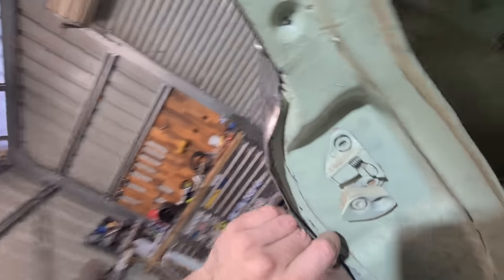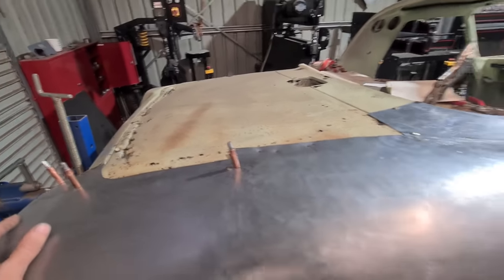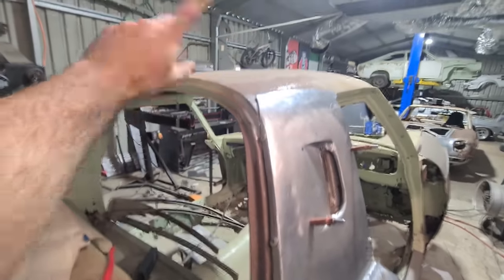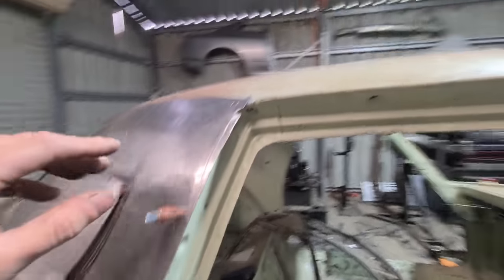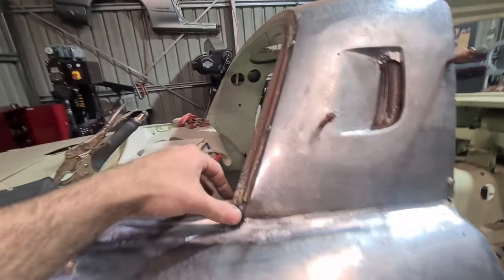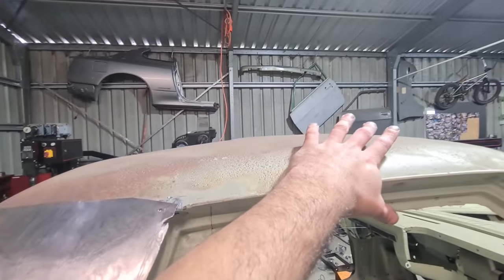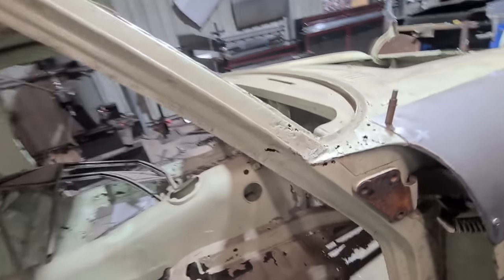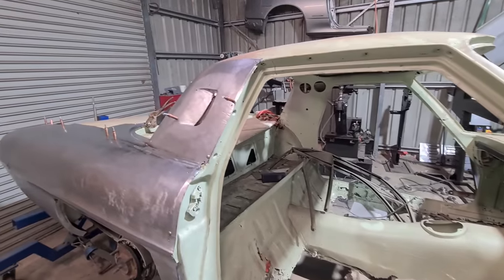While I have it off I'm going to turn the door edge and trim the boot edge back. I haven't made the window surround or the door jamb piece because I'm undecided on my approach — I do have a whole roof cut. I'm choosing between making a section here with the door jamb and then making the roof myself and keeping the roof cut instead of ruining it. But the pillars are pretty sad all around so I'll decide that in the future. My only issue with replacing the roof cut is I don't want to do a cut-and-shut of the inner pillars — I'd rather do little patch repairs on them.